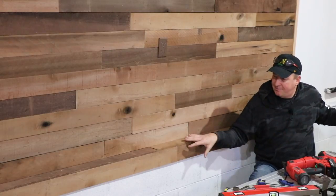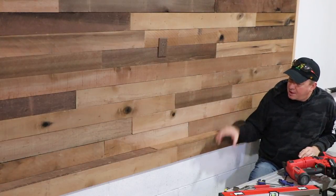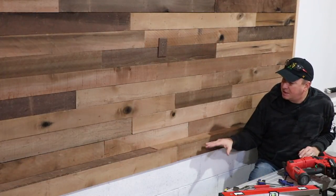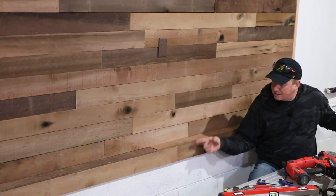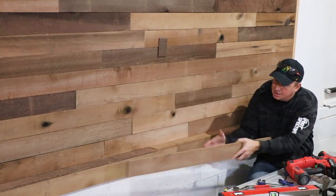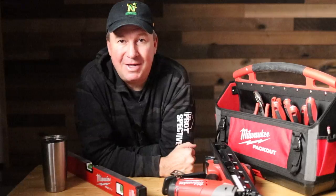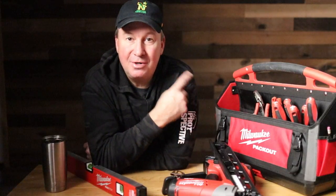One final step I did was the very bottom piece. I wanted a transition underneath where the wall attaches to the concrete block — there's a treated 2x6 or so underneath. I covered that with a horizontal wall board, and then I took another full piece and put it vertical to create a nice transition around that area. I'm really excited with the way this turned out — it definitely was a fair amount of work, but I just wanted to make sure I was doing it right. Let's take a closer look under some brighter lights so you can see exactly what this looks like from all different angles.